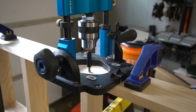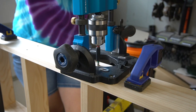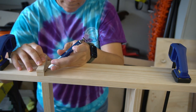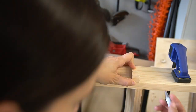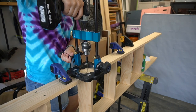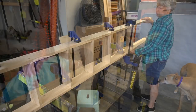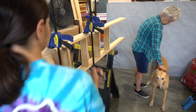To secure the steps further we're going to add two screws on each side of each step. I'm using our portable drill press to be sure they're nice and straight. I wanted to make sure these were placed in the same location for each step, so again I used our 12-degree jig, marked two lines on it, placed it right in the middle of each step, then marked where the screws will go. This worked out really well and I didn't have any issues with screws not going in correctly. Once one side was done we flipped it over, marked this side, and again used the drill press to attach the screws.